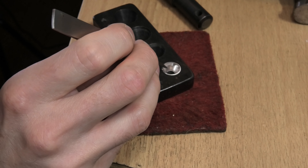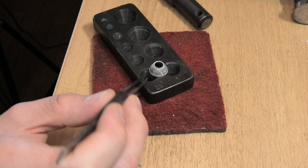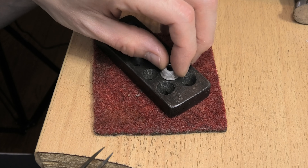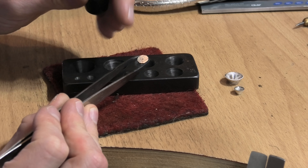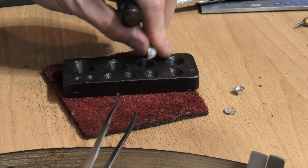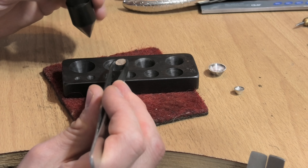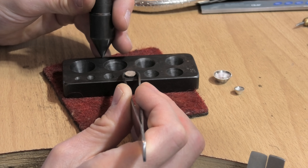I've reached its full potential for spreading out unless I get it down further, but it's just going to ball up that top bit on that edge. I'm going to try again with a much smaller disc and see if I can end up with a collet a bit more sensible size. But yeah, basically that worked! Now I know the outer diameter didn't really reduce that much - it was formed mostly by stretching out the bottom half. Let's try a smaller one.